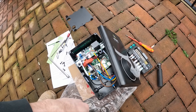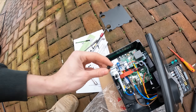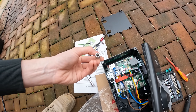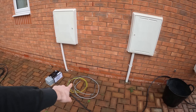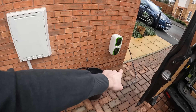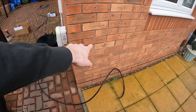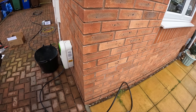Pretty simple. I've just taken the cover off and taken these screws out. I did struggle a little bit with those screws but I found a little trick — if you get your driver bit with a massive extension bit it fits down the back to get them out. What we're going to do is drill 10mm holes and fit EV Ultra clips all the way along here and around to where the charger is going to be situated on the front, so they can plug it straight in. 25mm stuffer straight into the bottom of the EVEC charger.